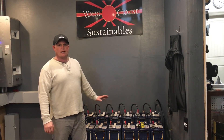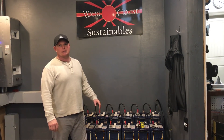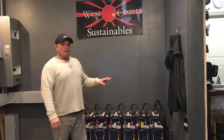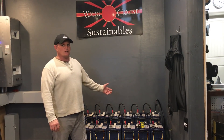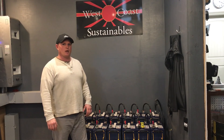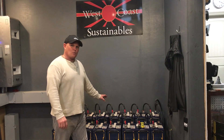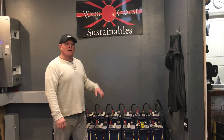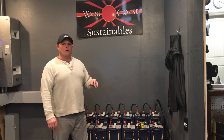This bank right here is close to that. We were in for a few months doing remodel stuff before we actually put these in, so it hasn't quite hit four years. I'd like to see five years out of these batteries before I start to really have problems with them, but we were starting to notice a little bit of heavy discharge from one of the cells, and the last couple of days I noticed when I was getting up, my batteries were lower than normal.